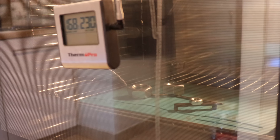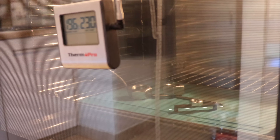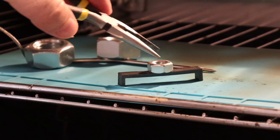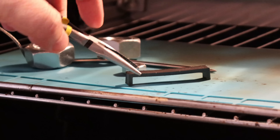Temperature test in the oven — I want to record the temperature of the first deformation. I had to analyze the footage and the first deformation was noticed at approximately 210 degrees Celsius. I stopped the experiment at 234 degrees Celsius, and it was flexible at that temperature — PPS-CF would still be completely hard.